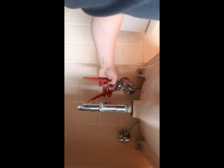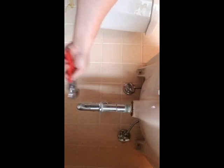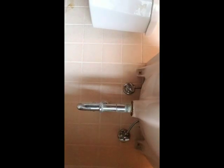There we go. Don't over-crank on them, but you do want to make sure your water is off so that you're not flooding everything. If you have any kind of bucket or anything to catch water in, use it when taking your trap off. That way you don't drip all over the floor. If you don't have a bucket, you can always lay some cardboard down or some towels on the floor to catch your mess.